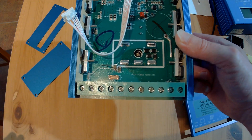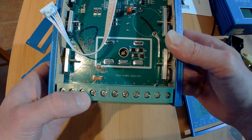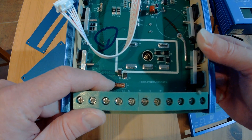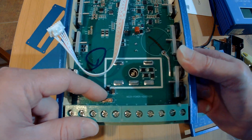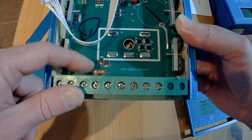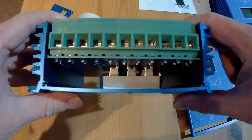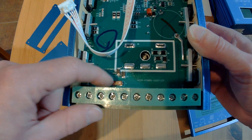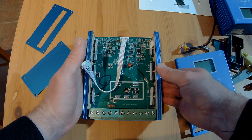Here you see all the connectors for the inside wires — positive and negative for the dump load, positive and negative for the battery, for the solar panels, and for the wind turbine. You can also add a load if you want. There is a fuse inside — not a circuit breaker — so if it burns through you have to open the controller and re-solder. The fuse is certified for 40 amps, and below the PCB the rectifier is a 50 amp version, also mounted on a cooling plate. So the controller will survive the certified power.